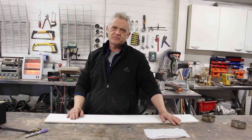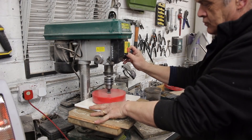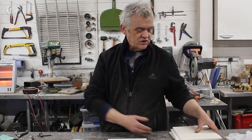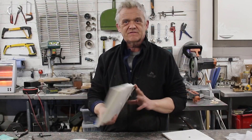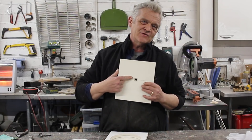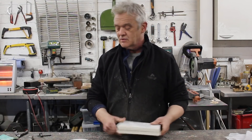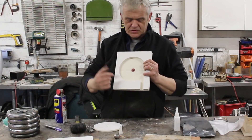The first thing we need to do is cut ourselves a disc. When you've cut the disc out, keep that part because it's going to be the housing — you'll need two of those to create a double thickness. Then we have a back plate, which is just a flat plate with a hole drilled in it, and a front plate which is exactly the same. These are drilled out to take skater bearings. We fasten all those together to make the housing, and drop an axle in the center. Let's glue those together.